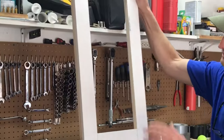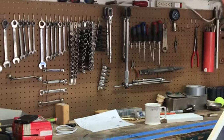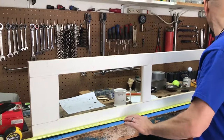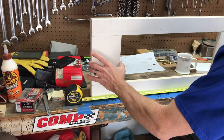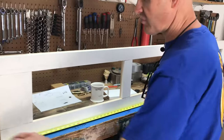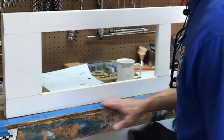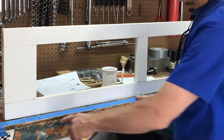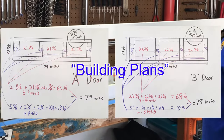To figure out the panels for the door and the measurements of the styles and the rails, we created a storyboard so that we could measure our doors. This way we could figure out our overall height was going to be 79 inches and we needed to figure out what the bottom rail and the two center rails and the top rail — all that math was going to equal up to 79 inches. We figured out that our rails were going to be two and three quarters and that our panel space would be 21 and 13 sixteenths.